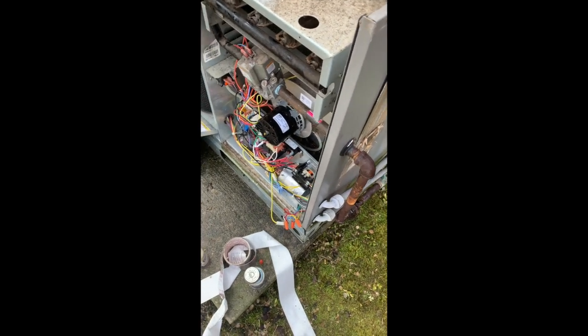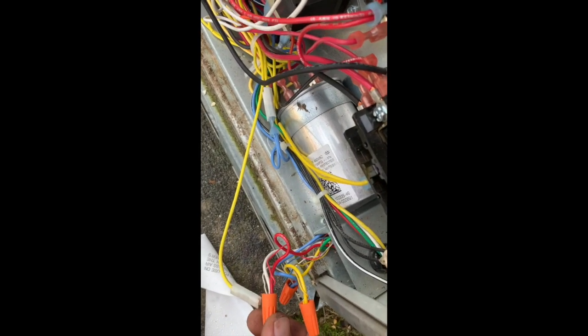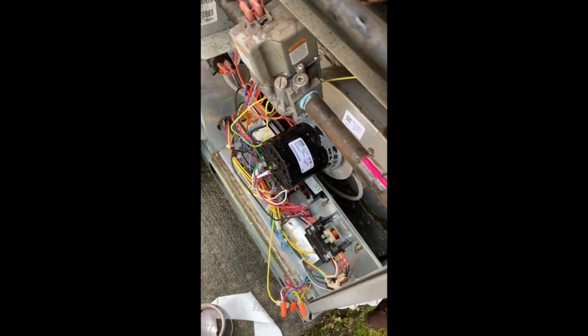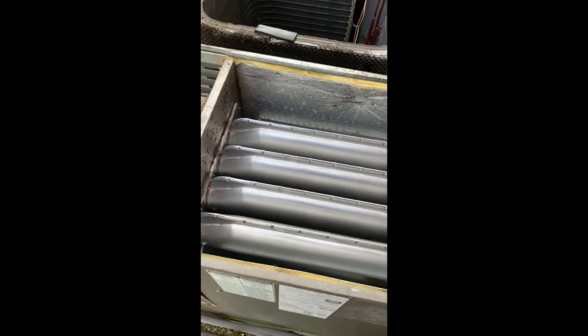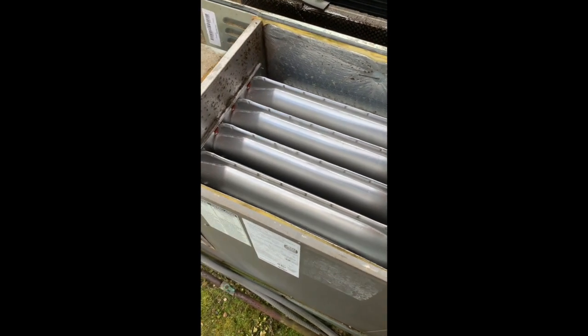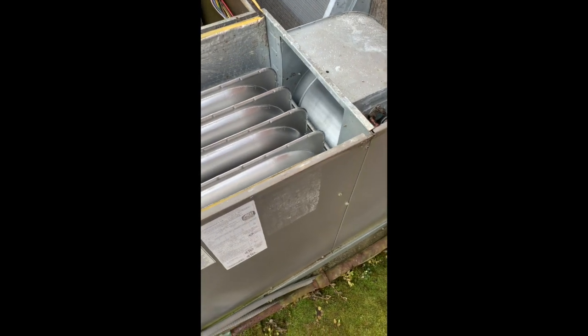I got my gas hooked up and I got our thermostat jumped out to heat right here, with the wire off the contactor to make sure the air doesn't come on because it's still warm here. These heat exchangers come packed with oil on them. We're going to smoke the customer's house up, so we're going to fire this thing off and burn this oil off while it's open to the atmosphere.